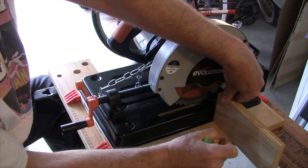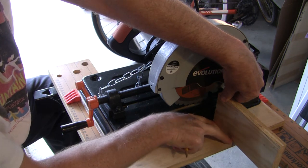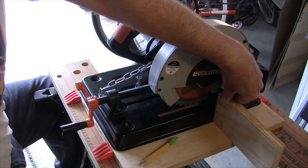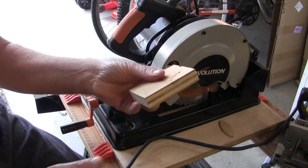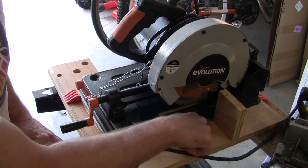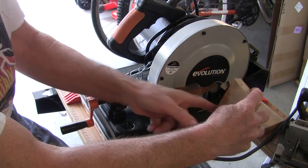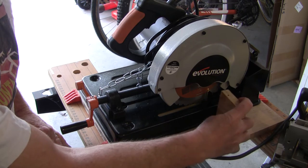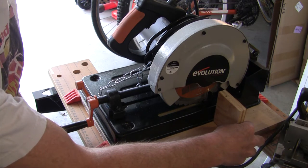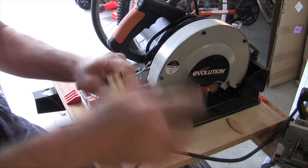This is about the right place. First we're going to cut off this extension fence to make it easier to work with — it's just going to be the same width as this opening here. So we're going to cut this off on the panel cutter like I did before. We cut it and it's just exactly the right width. There's a little lip here at the bottom. I don't think that's important — the main thing is we have an extension fence lined up with this so we can put a stop block on it. I'll just sand this off a little bit using our sanding sponge.